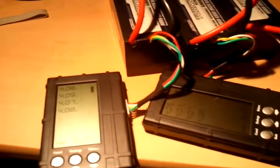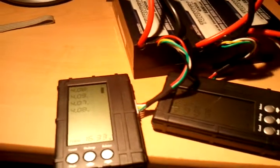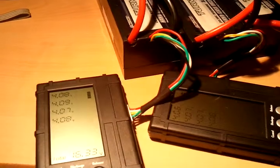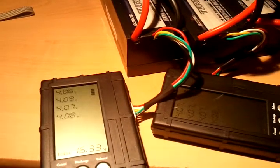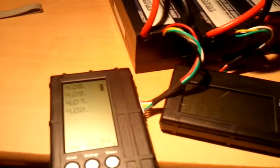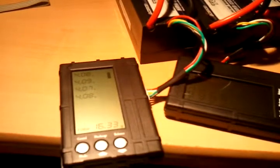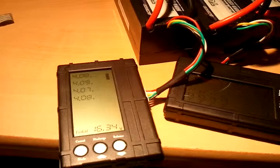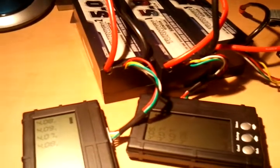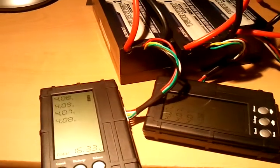Some of the weird things I've noticed: later on, the fan-off charging amperage was around 3 to 4 amps. Whenever the fan went on, it went to zero. Fan-off it was 3 to 4 amps. As soon as the fan popped back on, the amps actually fell to negative 0.01, which was the same scenario I had before I plugged in the meanwells — meaning the batteries were discharging into the meanwell very slightly. Basically, the meanwell was just cutting off supply to them as the fan was on.